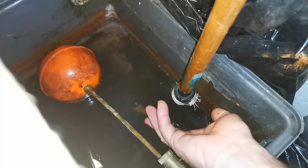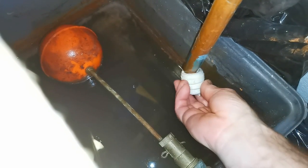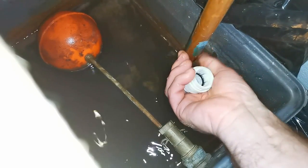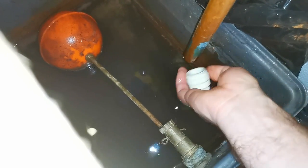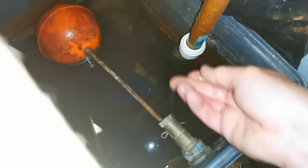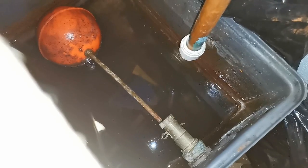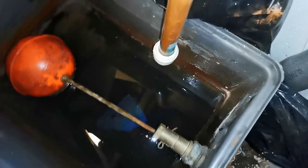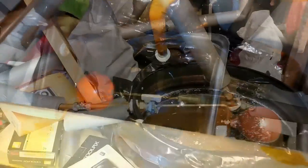Here I have a different open vent pipe which I'm going to cap off. Just make sure it's clean — no bits of dirt — so you get a good seal. Then I'm going to take my 22mm speed fit cap and push it onto the bottom of the pipe, making it wet first so it slips on easily. You could put some Vaseline on it so it goes on nice and easily. I'll add: if you have an older house you might have old imperial pipe work at three-quarters inch, which is very slightly smaller than 22mm, and if you use a push fit cap it might be a tiny bit loose, so a bung might be better in that instance.